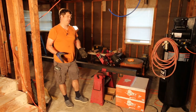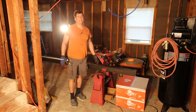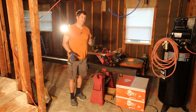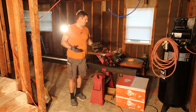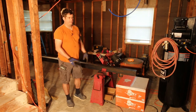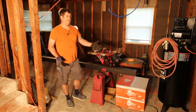One of the things I didn't talk about is how much steel I bought. It doesn't all have to be this size, but it is simpler for me as a fabricator — especially an amateur fabricator — to buy all my steel the same size. I could have bought smaller pieces that were thicker because the shape plays a certain factor in the engineering, but it's the quantity of steel that actually does the work. I happen to like the four inch size — it looks very beefy, solid, and industrial, and that's an aspect of the design I thought was desirable. My welding cart, which is sitting right over there, is made out of this exact steel.